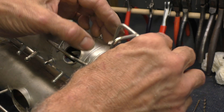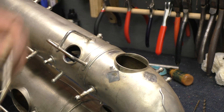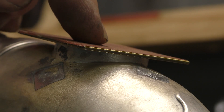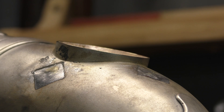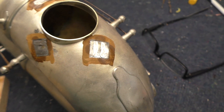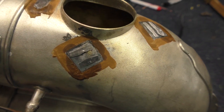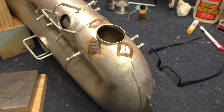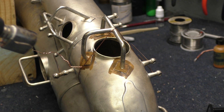After a lot of tweaking, bending, and fitting, I've got this tone hole guard all ready to solder back on. Also went through the tone hole here and leveled it with my flat piece of brass — no light leaks going on now. I've got everything prepped, with red ochre painted around the outside areas where I don't want solder to flow. I've also got pieces of Tix solder pounded flat and stuck in place with a little bit of resin. I'm going to carefully position the guard, wire it on with some copper wire, and solder it up. All wired up — let's get heat on it.